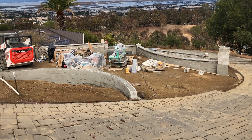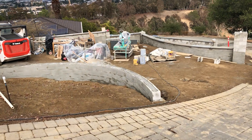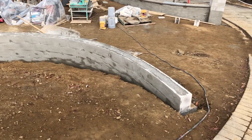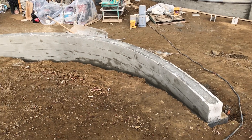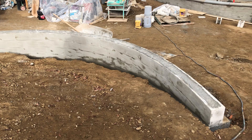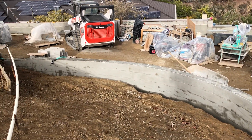It's the afternoon of October 21. The waterproofing on the backsides of all my retaining walls has been installed. I use a product by Quikrete called HD masonry coating and I use their acrylic fortifier to help with the bonding. It's my understanding it toughens it up.